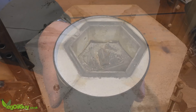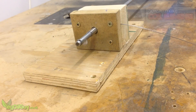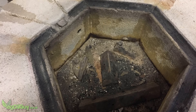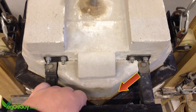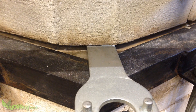Before I could use my electric furnace this week, I had to strip it down as one of the coils had blown. Luckily the way I built it made this easy, and making new coils was child's play thanks to my coil-making jig. But I did notice these recesses were a little charred. Research tells me that burn-out ovens are typically vented, so now during burn-out I leave the lid open just a little to help vent any steam and smoke, and hopefully prolong the coil's life.